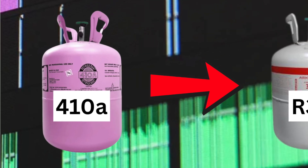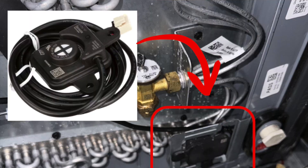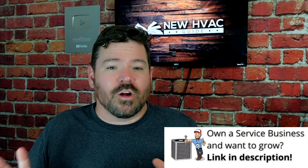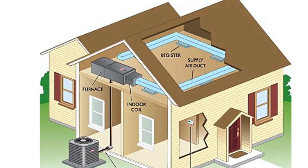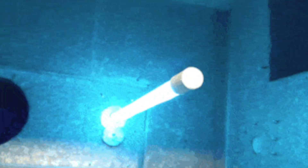Let's dive into this. Why are you seeing this code? What is the problem here? To answer that, let's back up a little bit. As many of you know, we made the transition from 410A refrigerant to R32 A2L refrigerant. And being that it's an A2L refrigerant, we have a whole set of new ways of doing things. One of those things is that any A2L refrigerant introduced to the market now will need to have a mitigation sensor. If you've got a furnace or air handler, chances are you're going to have a sensor somewhere located in that system. That sensor is looking to sense a refrigerant leak. If there is one, it will send the system into mitigation mode — it'll bring on the indoor fan motor, turn off indoor air quality products, and turn off the outdoor unit. It's all about safety.